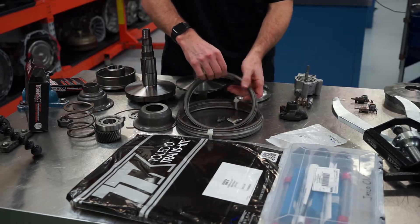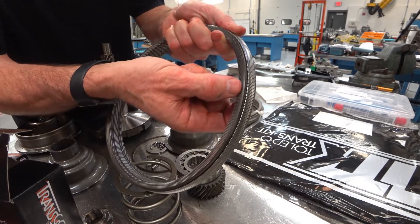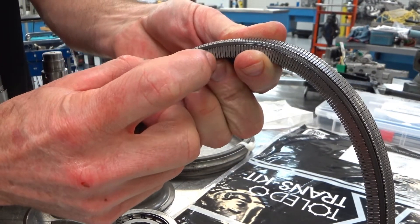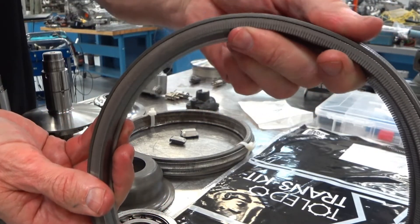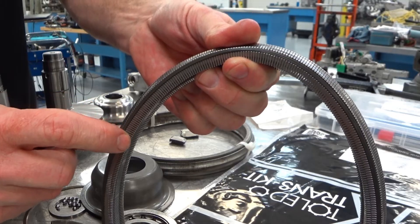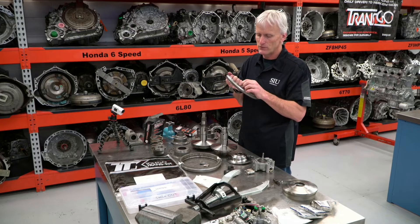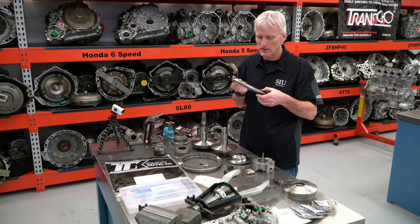And that brings you to the next topic — the belts. When you inspect the belt, you're actually looking at the sides. If you look from the side, they make a pea shape — they look like individual peas lined up against each other. This thing rotates in the direction of the peas. You look at that surface to see if there's been damage. It should have ridges like the edge of a quarter or a dime. If it's smeared at all, then it's bad.